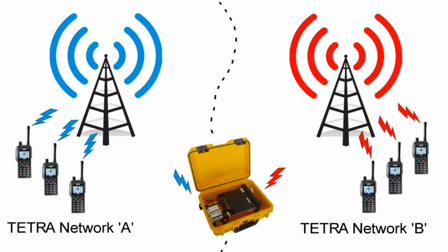For GPS sync, you've got different configurations. Automatic synchronized config, or ASC, means it can sort of free run using its internal clock for a while if it loses the GPS signal. There's also a forced non-synchronized mode, FNC, but the manual generally advises against it. Lets us start without GPS, but timing accuracy is crucial. Think about it. If the frequency drifts even slightly, calls could drop or get garbled. So it needs that accurate timing, usually from GPS and periodic checks or recalibration.